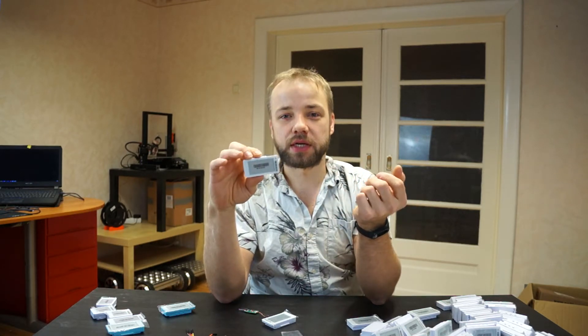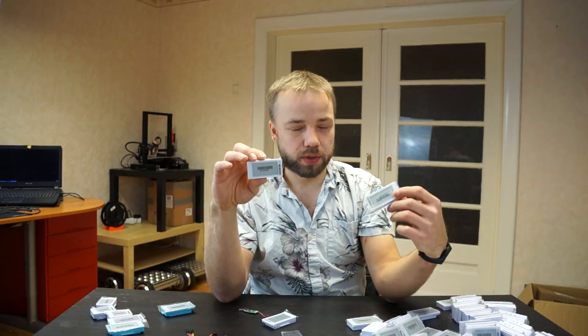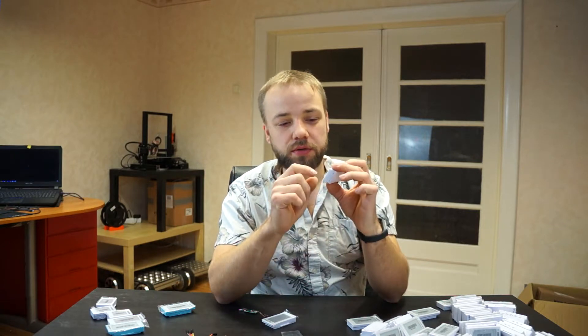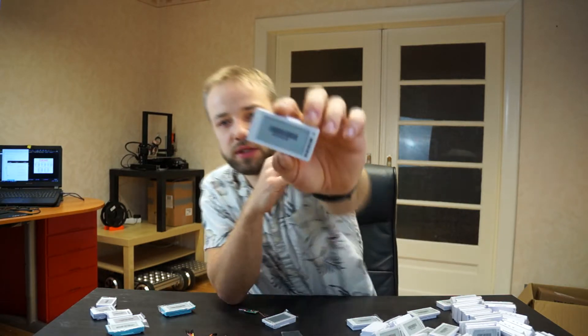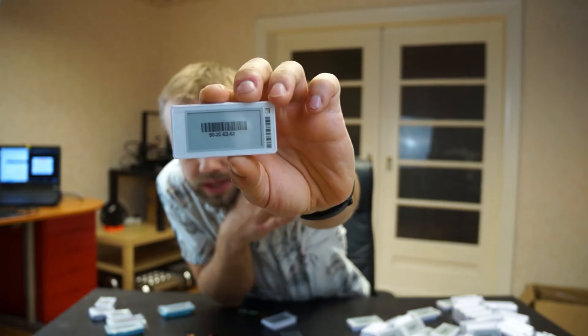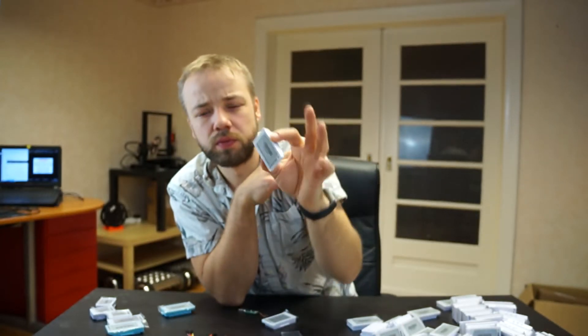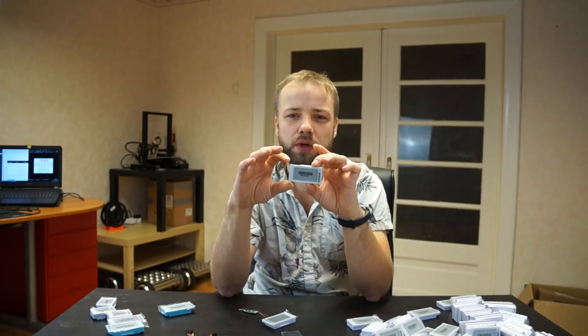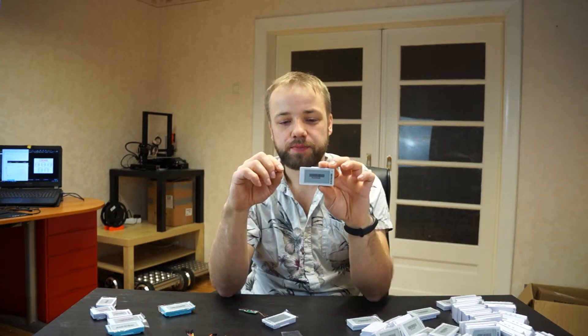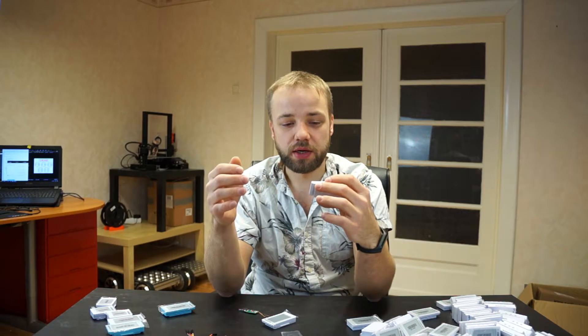I made custom firmware for the Xiaomi thermometer and was able to snag quite a few of these from eBay for not much money. I was happy they use the TLSR chip. You can detect whether they use the TLSR chip by the LED on the top: if it's black, it has a CC-something chip with an 8051 core; if the LED is white, you get the TLSR version.